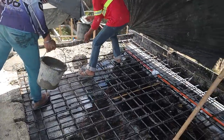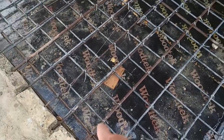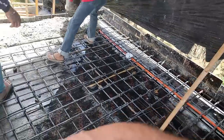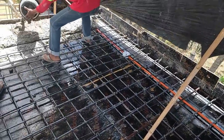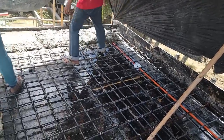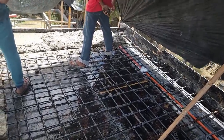I want it strong up here on this little balcony. We put a lot of steel in it — got 16mm on the edge, 16mm out in the front on that little beam, 16mm through the middle, 16mm going across the other way, and the rest is all done in 12mm. That's millimeters, not like in the US where they say bar number so-and-so. Here you buy 8mm, 9mm, 10mm, 12mm, 16mm, and so on up.